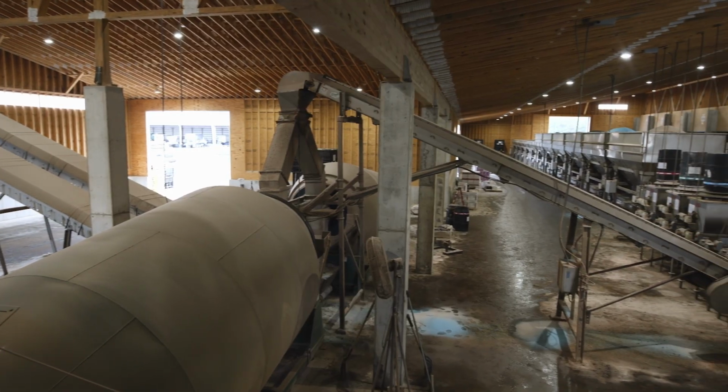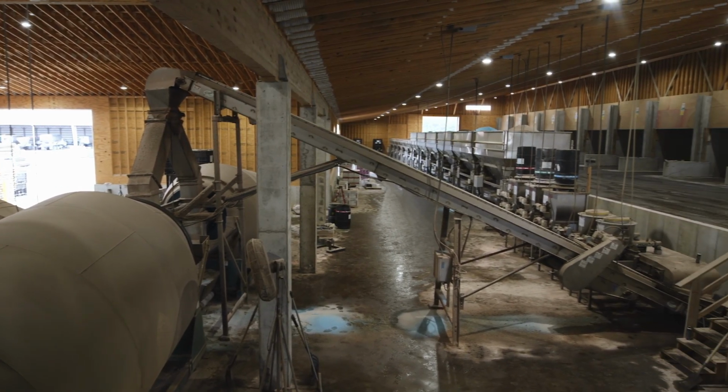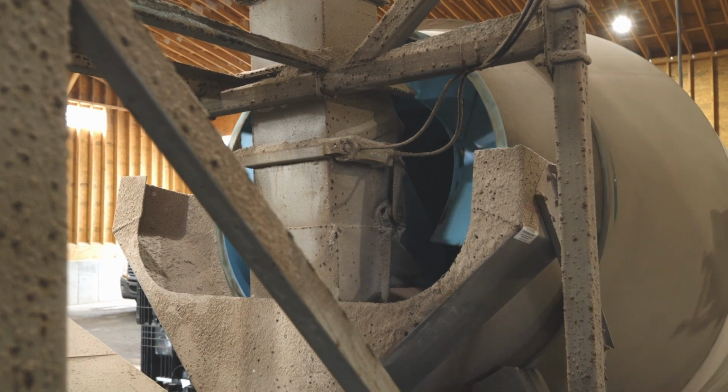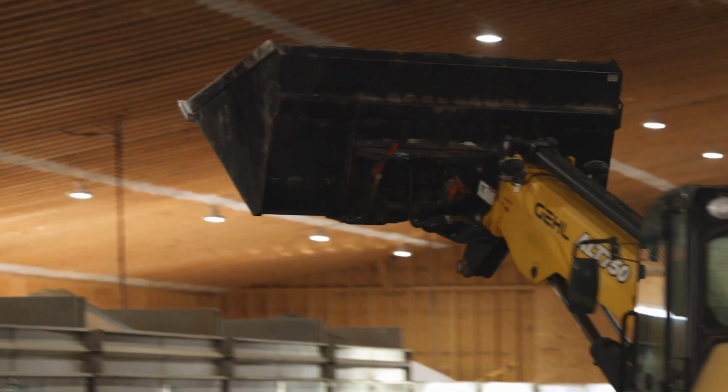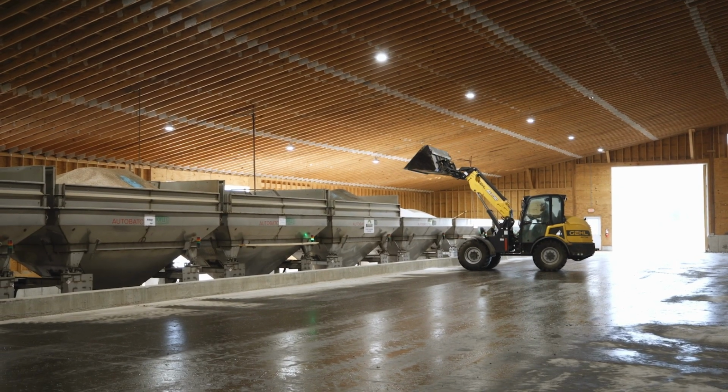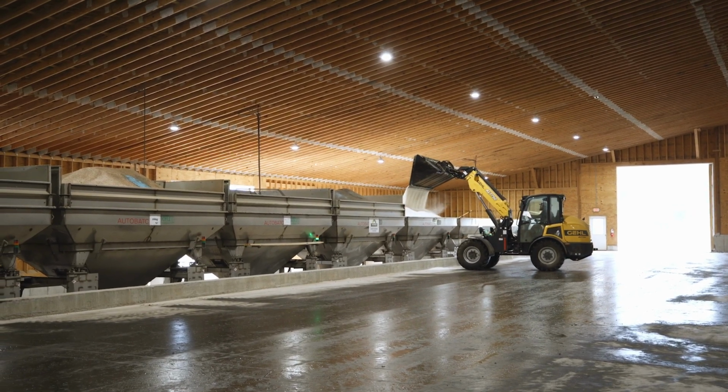Before mixing, it's crucial to ensure that WOLF TRAX is primed completely to the end of the discharge pipe of the powder feeders so the system can accurately measure what's needed. After fertilizer is loaded into the appropriate hoppers, it's time to start the blend.